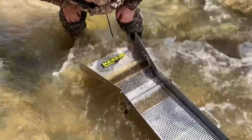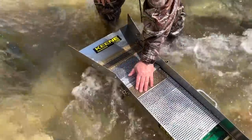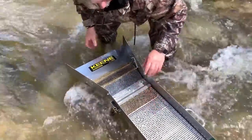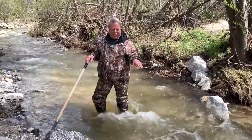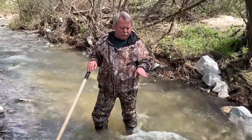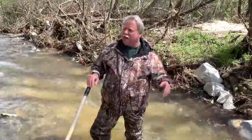We just switched over to a little bit larger front screen and a shorter woven mesh. We just changed it out to the half-piece of the woven mesh and a little longer grizzly bars in front, which is going to increase the pressure in the very front and allow some material to dive. But we've got to see how it's going to react with the material — so let's try that out and see how it works.